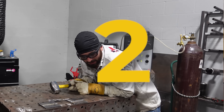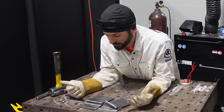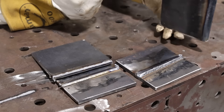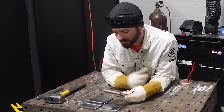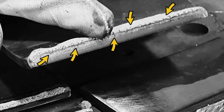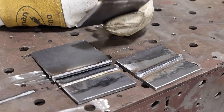Let's see if I can do the same number of swings or fewer on the laser weld — and man, that snapped right off! So as simple as those welds were, the data is still interesting. The MIG weld took considerably more hammer strikes to break — we even bent some of the steel, which has a lot to do with the weld reinforcement. There's also some porosity visible in the root of the MIG weld; not sure where that came from.